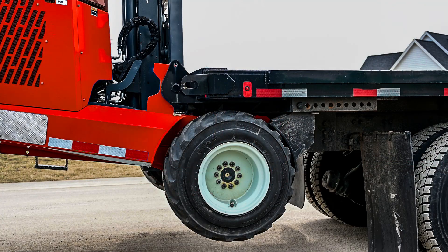Your Moffett is designed to be transported on the rear of a truck or trailer using a hook-style mounting system with adjustable wheel stops. During transport, the weight of the forklift is carried by frame hooks resting on two hardened 2-inch mounting pins. The 2-inch mounting pins create a fulcrum or pivot point that allows the front tires to engage the tire pads, acting as shock absorbers as the forklift is transported down the road.